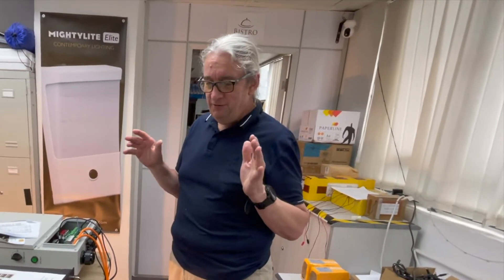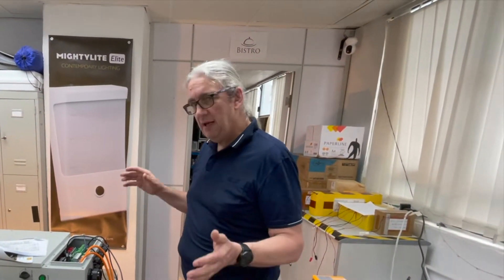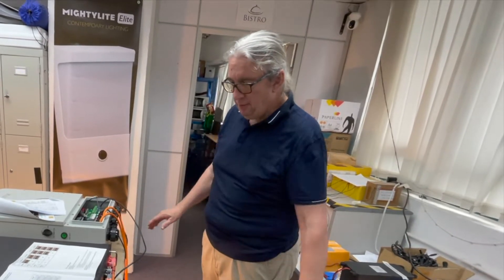Hi. I'm just going to clarify something because a few people are having difficulty with the batteries. When you're using the batteries, the first thing you must do is make sure you've got good communication. If you're setting the system in parallel, all batteries must be connected together on a common bus bar. Very simple operation.